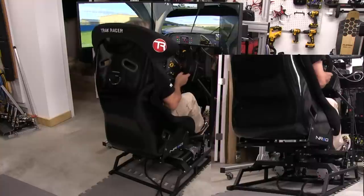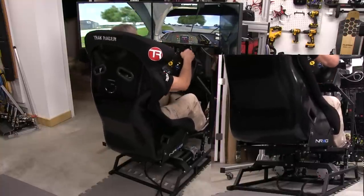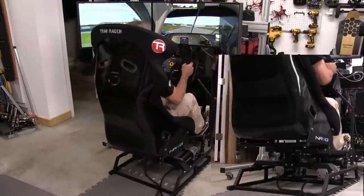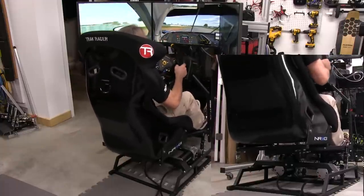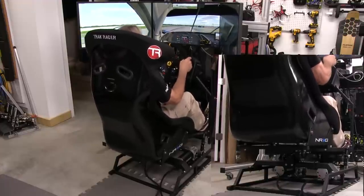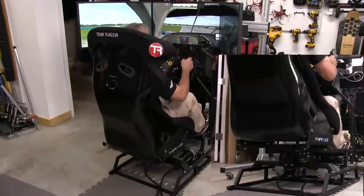And I'm not saying this is the smoothest thing in the world either. It's not. And really, when you're using electric motors, and this has always been my opinion of it, it's the nature of what we just call a wiper motor motion system. It doesn't have a very soft stop-start function in these motors and gearboxes. So it doesn't have a soft landing, and it doesn't have a delayed smooth start when the motor goes in the other direction. It's abrupt.